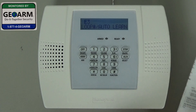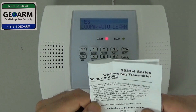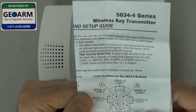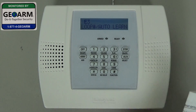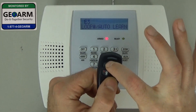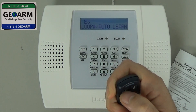Now it's important to verify that you're using the correct loop with the actual material that came with the key fob in the red box. You'll notice there's a diagram of the buttons. Right now we're doing armed away — you want to make sure it's on loop three. On our system it looks as if it's on loop three, so we're good. Now we're going to learn this sensor into the device by holding down the arm away button once, releasing, and then holding it again: hold, release, hold.